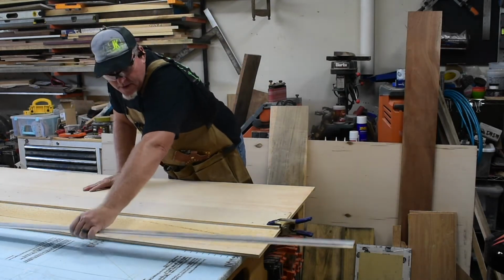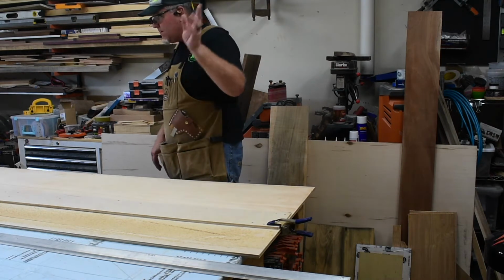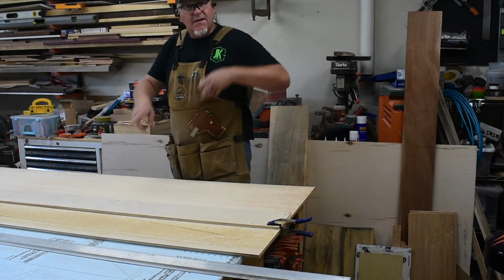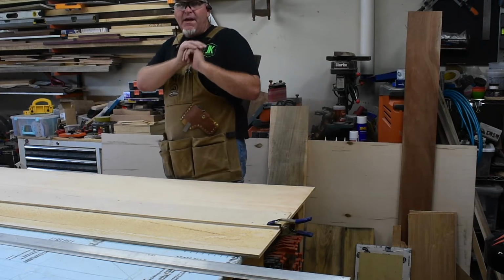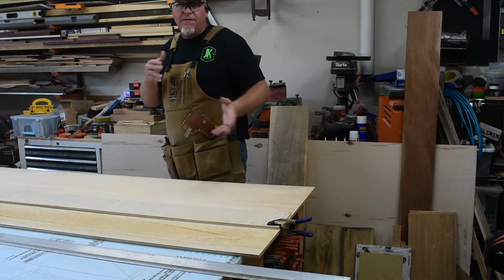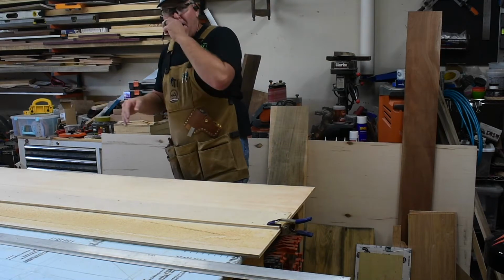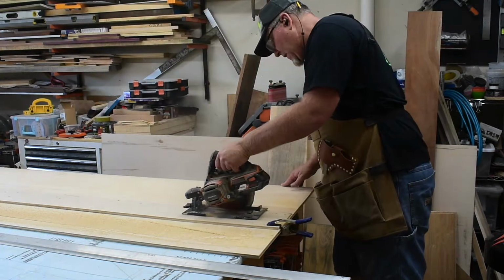But the other thing that I'm going to use is a zero clearance guide. I made this for Penny to use on one of her projects. But DIY Tyler made a video on how to make these, and I'll leave the link in the description up here in the corner. But anyways, it takes all the guesswork out of how much you need to add or subtract from your board to get the actual cut. Because as soon as you make it, you cut it, you know that that's your cut line for your saw. So I'm going to show you how that works, and then we'll move on.